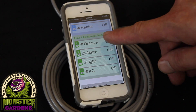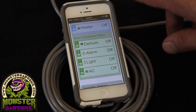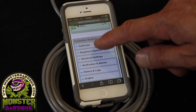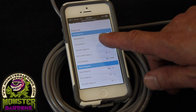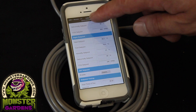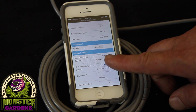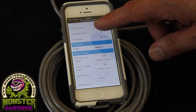Then in Zone 2: dehumidifier off, alarm off, light off, AC off — so everything's cool in room one and room two. You scroll down — look how easy this is — you have your set points. Click on set points and you can change your heat temperature, cool temperature, humidity, dehumidity, and CO2 for both sides. Amazing. There's also a time delay — right now it's set to an 8-minute 30-second delay. Awesome.